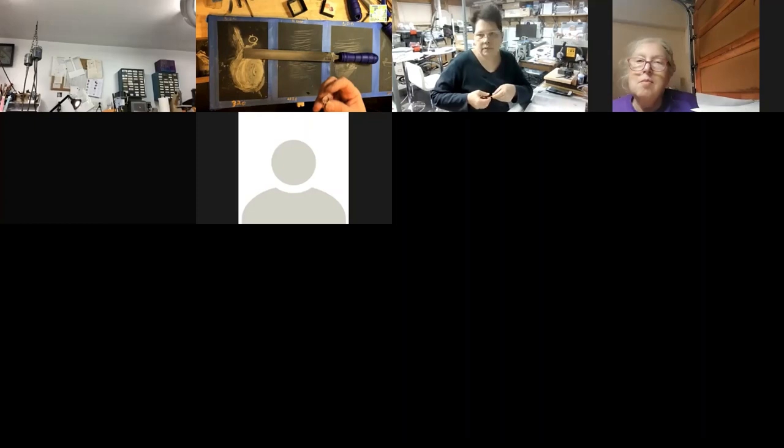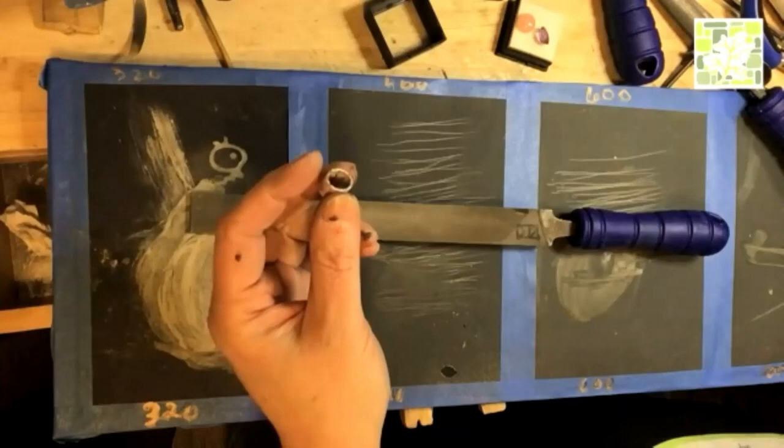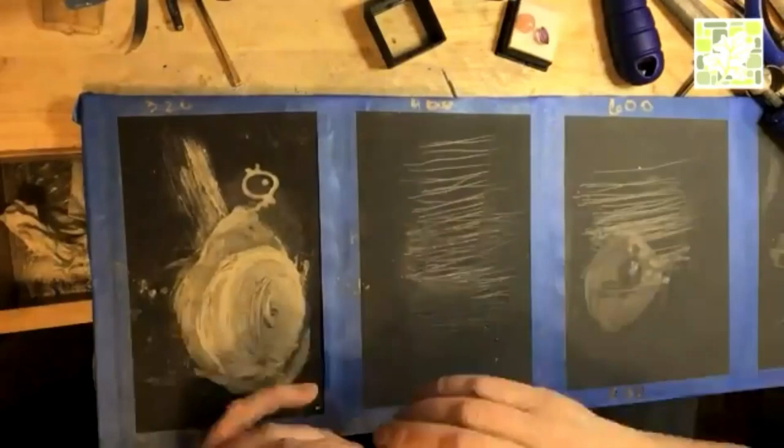So on my filing, one of the things that I'm doing besides the outer wall, if I don't drop the piece, is I'm filing the bottom. And I know I've done a good job soldering if the seam line disappears. So I say either file or sand or a combination of both. Because you can see the two lines, but by sanding it down, I need to spotlight myself again. So you can see that we've got a fairly close seam, but until I actually sand and file it down, that's when the magic happens. That's when it disappears and it makes it look like there's only a single wall of metal. And that's when you've got success with your soldering and with your snug fit.